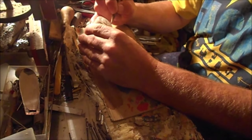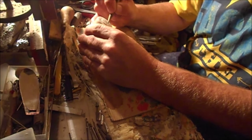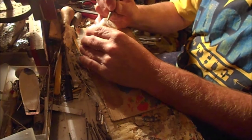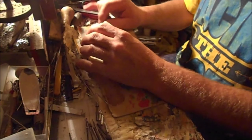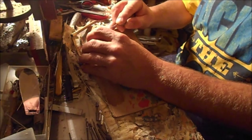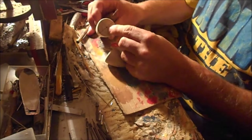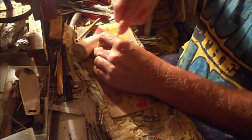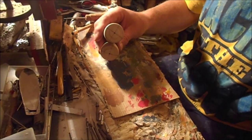You can see it's a bit rough there, but that's okay. I'd rather refer to the center of the remaining stem than the marker lines. In the end, my reference would be my own eyeballing abilities rather more than the marker lines. Now I'll make another indention in the center — and on the head portion as well. Two indentions in center. Now comes the delicate bit, which is drilling free-handed.